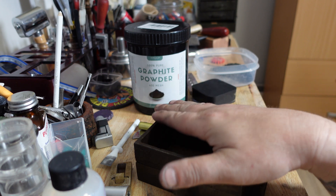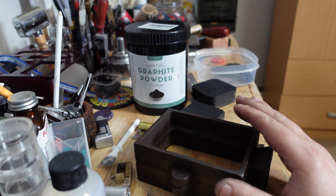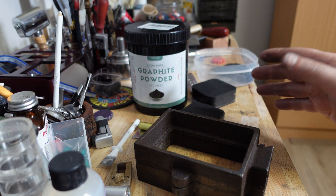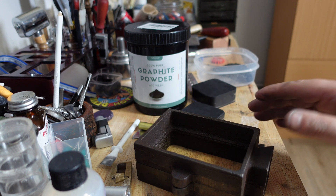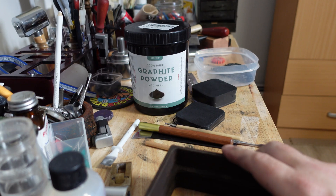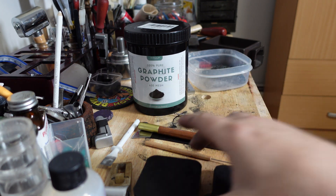But for this purpose, silicone is totally fine. With all sand casting, the tiny part of the mold that touches your part is sacrificed anyway — you discard that in all forms of sand casting. And because this mix is primarily silica, clay, and graphite, you're using very little silicone, so it's not going to be an expensive process. This material is completely reusable. And I think the most exciting part is the material itself — because I'm using silicone, it no longer acts like regular sand casting material.